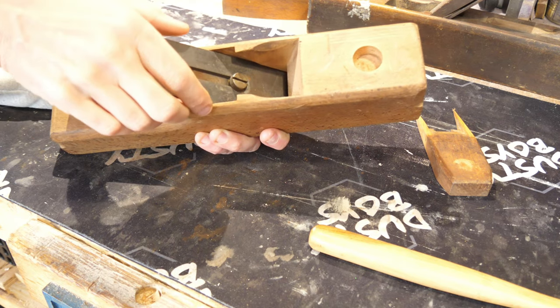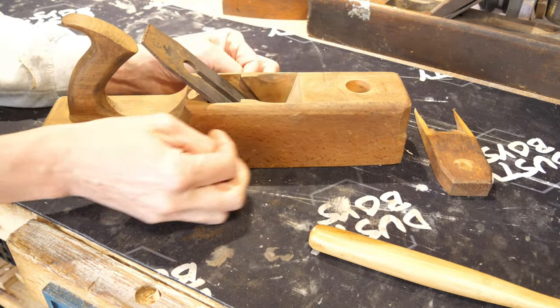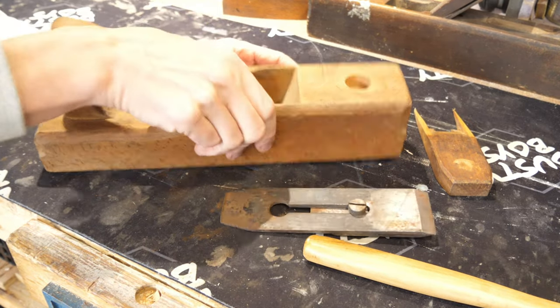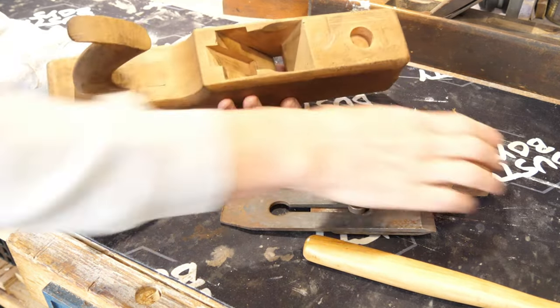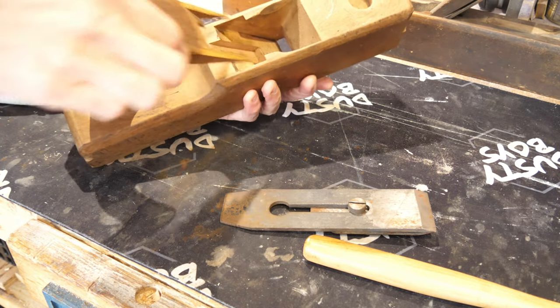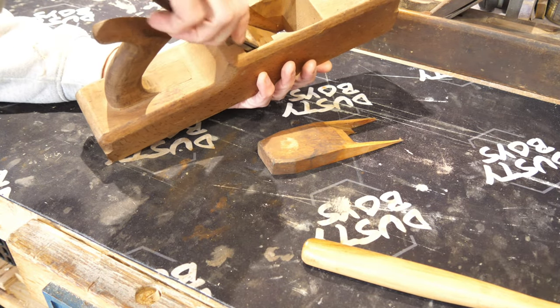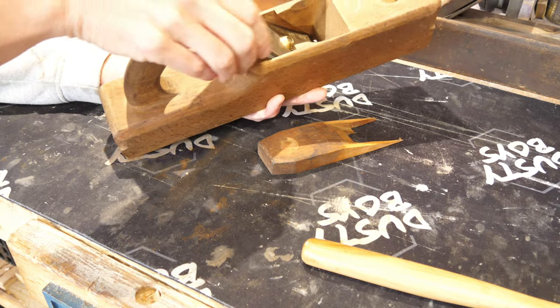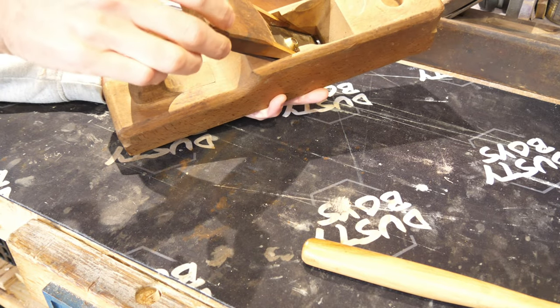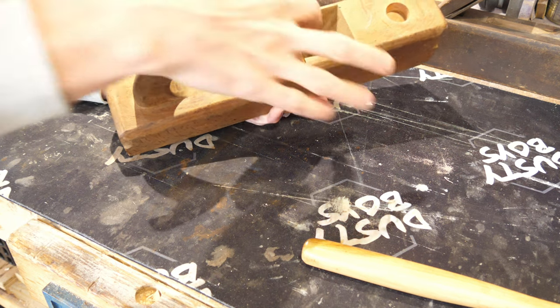If it's too tight or the wrong iron's in there, these can sometimes contract, bulge and split out. So that's good. The abutments are square. That's obviously what holds the wedge tightly in. And when I put the iron in, just resting it on my fingers, I can follow that wedge and I can see that as it goes in, it's going to fit the right angle.